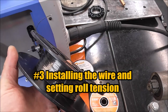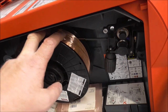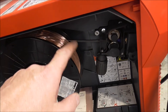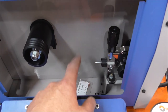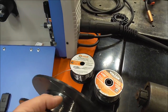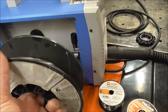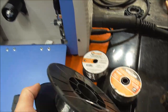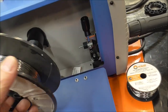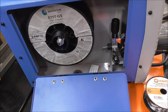The next tip is getting a new reel of wire onto the machine properly. All machines feed the wire a little differently — you can see that in this machine it feeds from the top, and the drive roll system is at the bottom. So the first thing you want to do is prep your wire while it's still on the reel. Let's simulate this as a new reel — it'll be stabbed through the case like this, and because it's feeding off the bottom, the wire would go onto the reel like that.